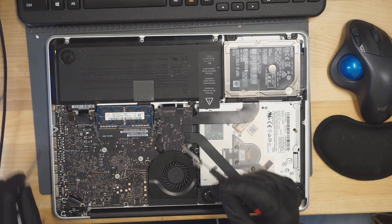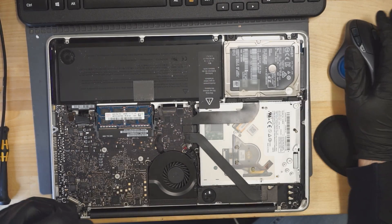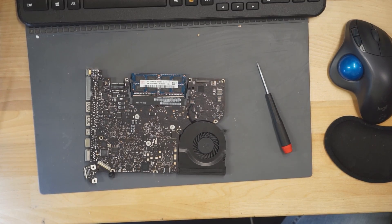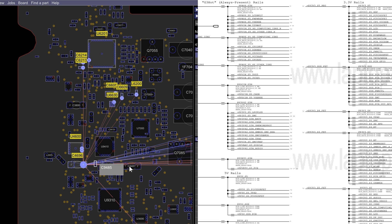Hope you're all excited that we're going to fix yet another MacBook, because that's what we do here on this channel. We're going to lower the power supply down to 5 volts, maybe even just 1 volt, and output that into where I think the short circuit is. According to the schematic and board view, PP5VS3 is right here.